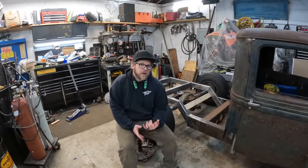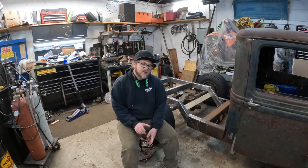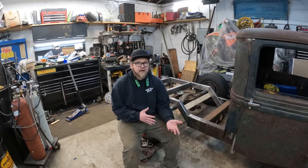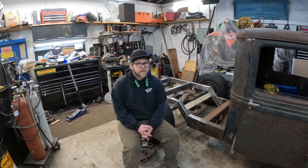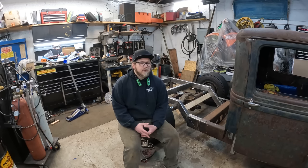All right, so after putting in the majority of the front springs that I had from the original spring pack on the truck, I was able to significantly bring the rear up, which was awesome. She's still sitting a little low, which isn't a big deal. I mean, after all, my longest spring that I had to put on is about 8 inches short on either side of this, like, I guess 37 to 40 spring, you'd say. So it's understandable. So once I get the right spring pack in there, that should change.